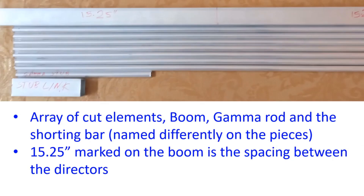Next, I checked the inventory of tools which I already have and found it is almost enough to start with. I had a collection of drill bits along with an electrically driven drill, extension board, hacksaw, red marker pen, measuring tape, and a small transparent scale as seen in the initial picture. Initially, I marked out the positions where I had to drill holes on the boom for the various elements using the measuring tape and marker pen. Next I marked the places where the 3/8 inch pipe has to be cut to form the antenna elements.